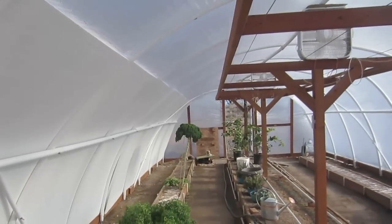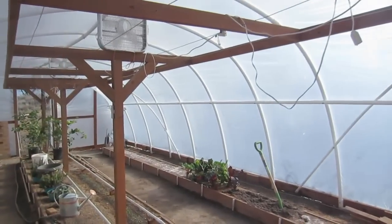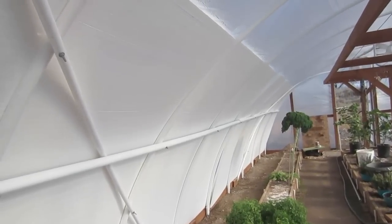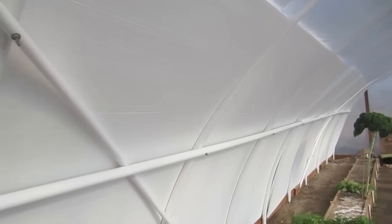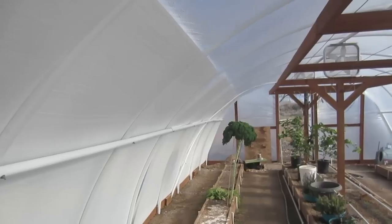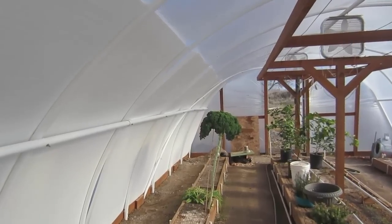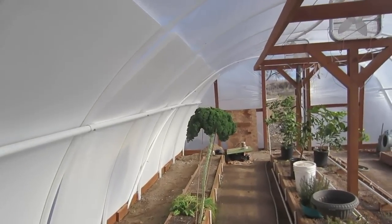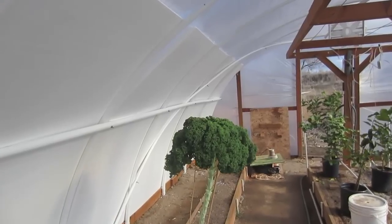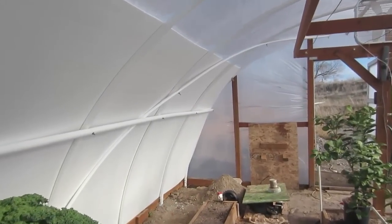The end you see here in this footage is facing east, so behind me is west. This wall here is the north side and this wall over here is the south side. I was noticing the north wall is substantially colder than the south wall, so I took two layers of one-inch styrofoam and put those up there in between the plastic and the PVC pipe. That brought the temperature up so that at night when it's really cold outside, it is 27 degrees warmer in the greenhouse. I've been monitoring that for a couple of weeks and it's pretty consistent. The colder the outside temperature, the bigger the spread. But once you start getting into 0 degrees and minus 8 degrees, which is what we've had here in the last few weeks, 27 degrees difference is not going to cut it.